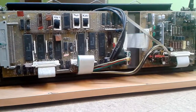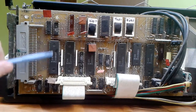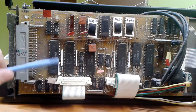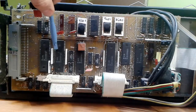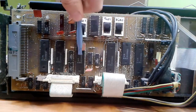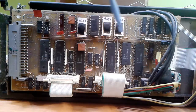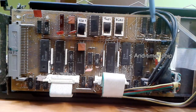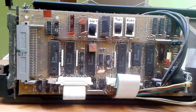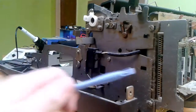And now let's move to the chips. This one is a Z80 clone. Then by the parallel bus it is connected to four chips, which are input-output buffers. Each of them has three 8-bit configurable I/O ports. Here are EEPROMs. This could be static RAM. Also for expansions, there's a connector with the CPU bus.